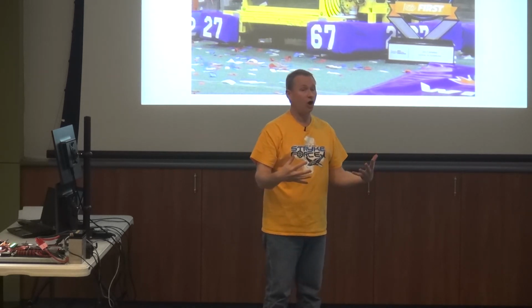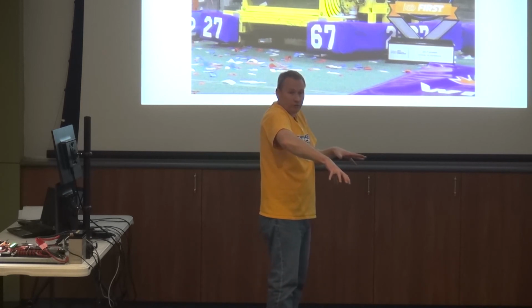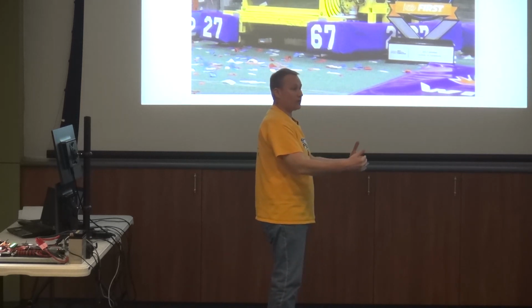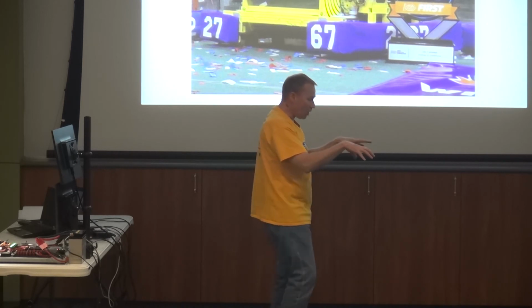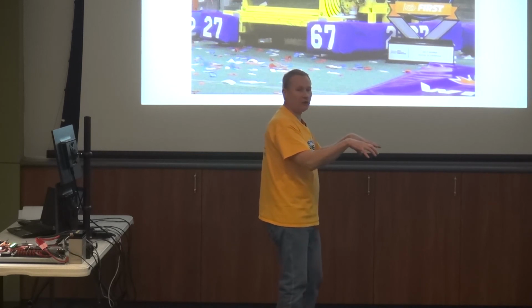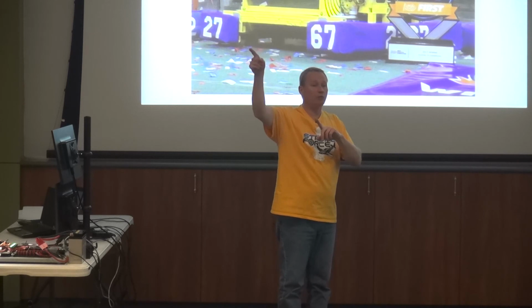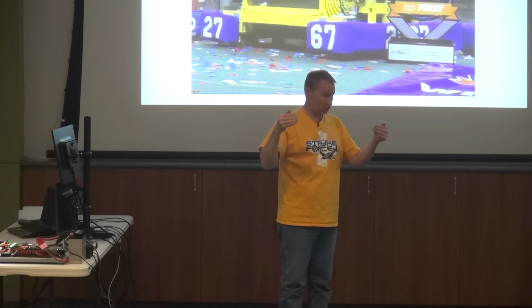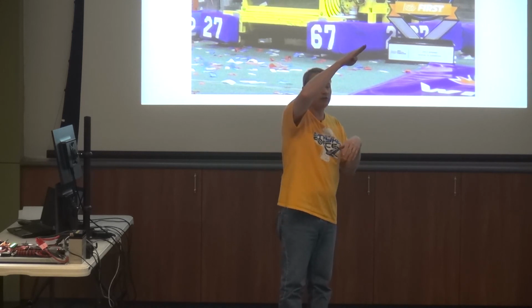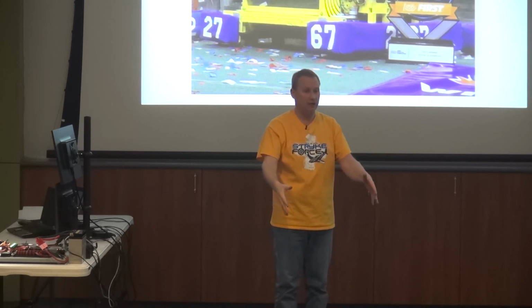And the Talons are running in a velocity mode on the wheels. So we turn all the wheels at 45. It's all set up in velocity mode. And now the RoboRio is in charge, telling the robot, all right, run your wheels at this speed. The robot's turning this way, and the RoboRio is watching the incoming data from the Jetson. And it's a position loop. And as you get closer to your answer, you slow the robot down, and it's the same tuning game.